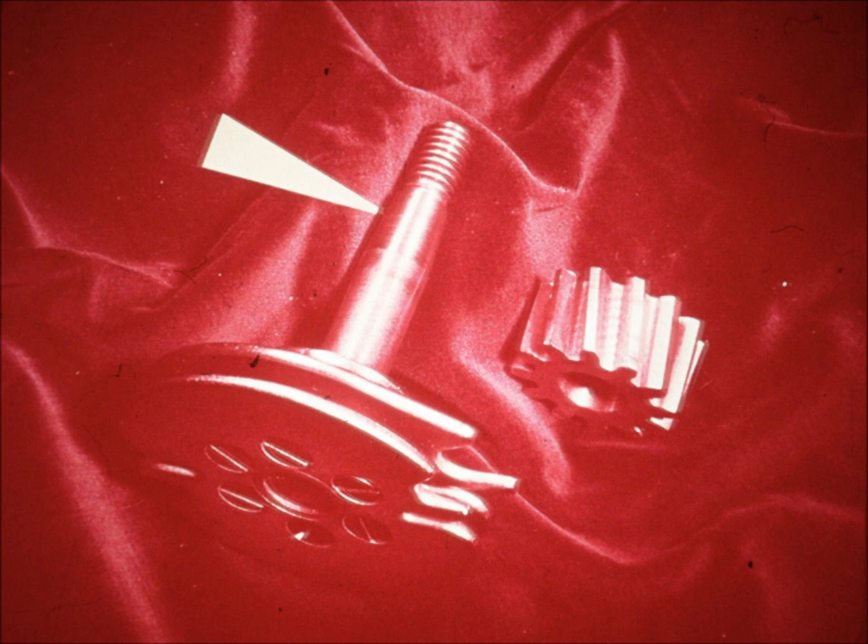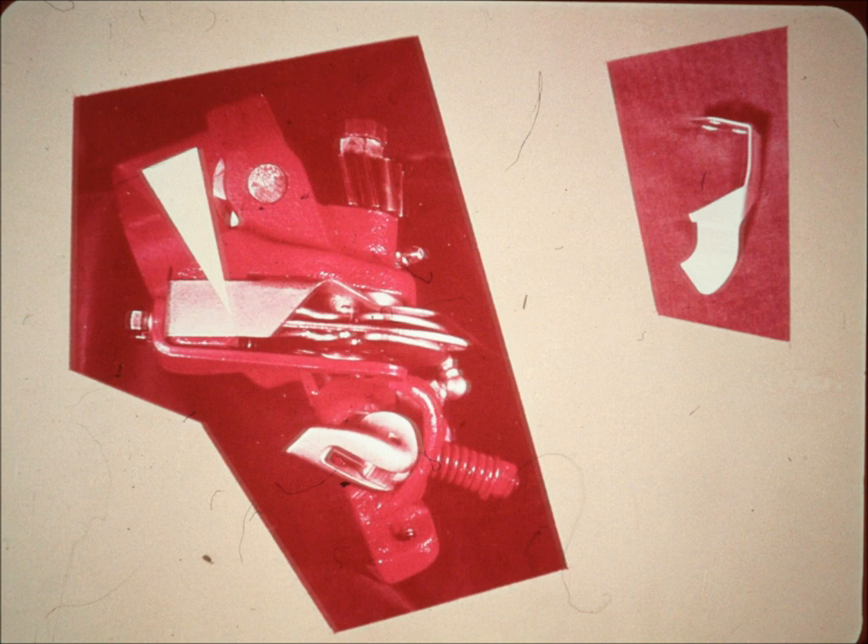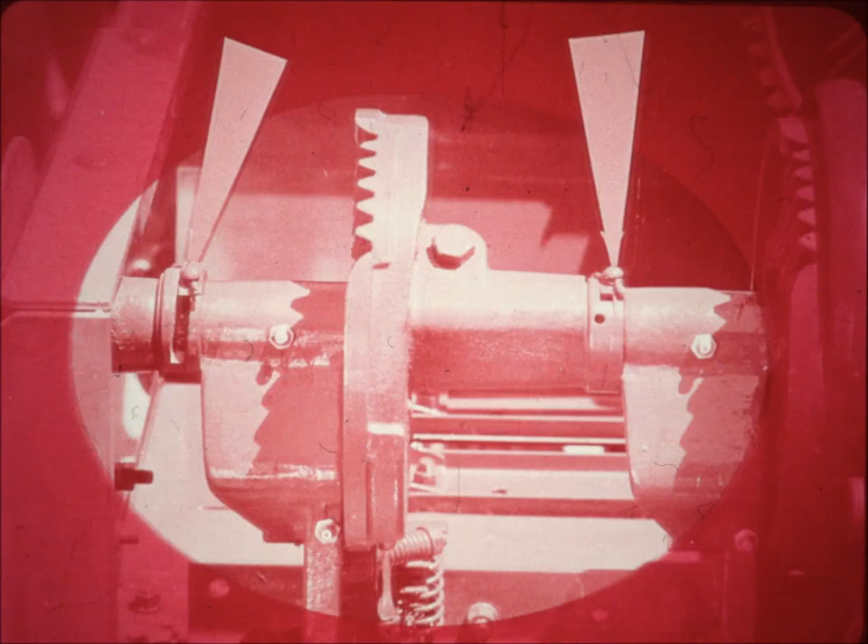The shaft and gear driving the discs are tapered to make timing a matter of seconds. A new retainer spring allows a greater variation in twine diameter; it compensates for the thick and thin spots so often found in ordinary twine. A new expandable collar on the knotter shaft compensates for wear between the knotter assemblies, maintaining positive engagement of working parts. Positive engagement assures proper timing for proper knotter performance.